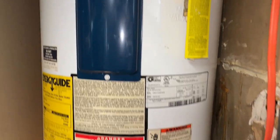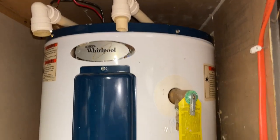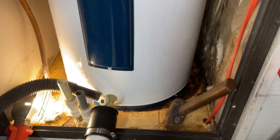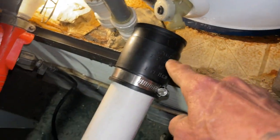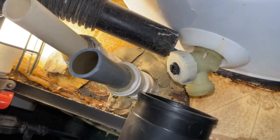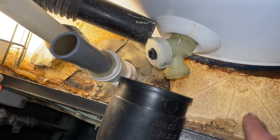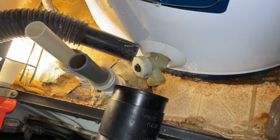30 gallons times 8 — think about that. A gallon of water is 8-plus pounds, plus the weight of the heater itself. So we're going to have to bust this spout out. I've got kind of a diversion happening out the door, but when we do that I'm going to stuff this up against the hole and run the shop vac at the same time to try to minimize the water. The only good thing is it's out here in the utility area, not inside the actual house.